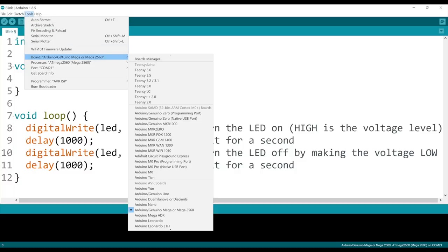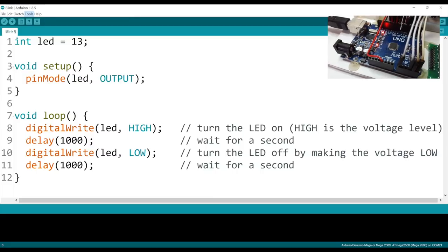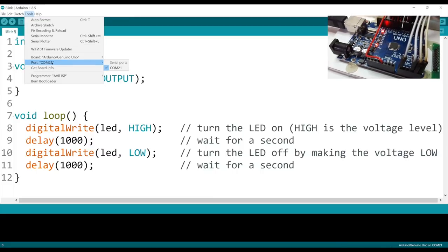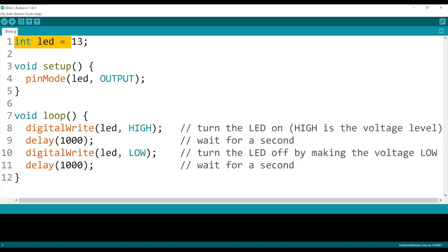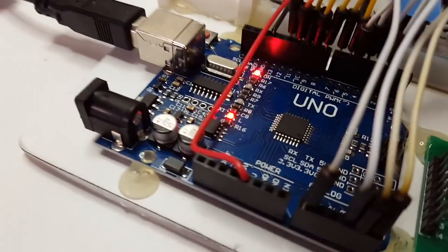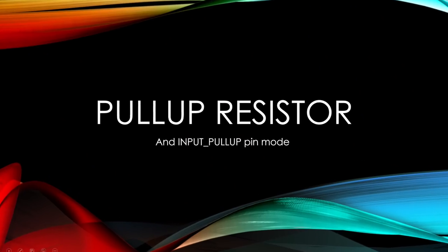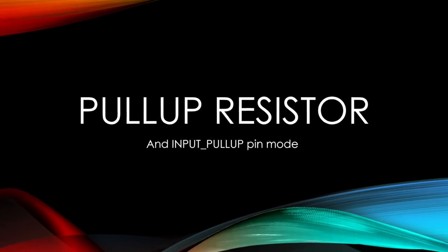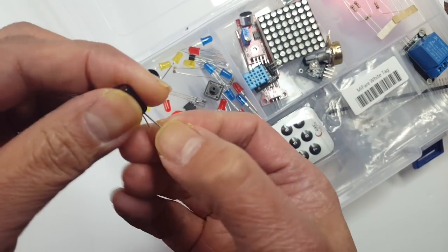Whenever we work with the Arduino, we've got to make sure we choose the right one. This is an Arduino Uno — make sure it's visible on the port. Then I always upload the blink sketch just to make sure it actually communicates. Control-U to upload, done uploading, and there is our blinky. Now that we know everything is working, we can start working on some code to detect the shaking of the dice.